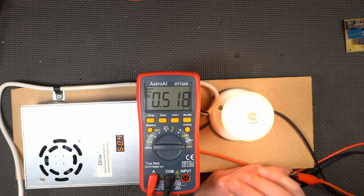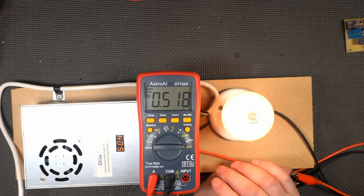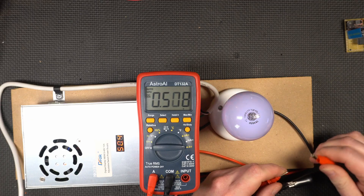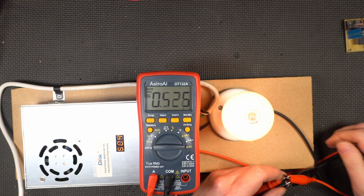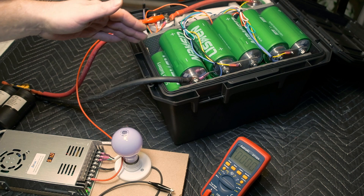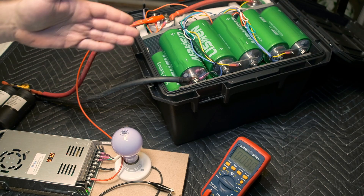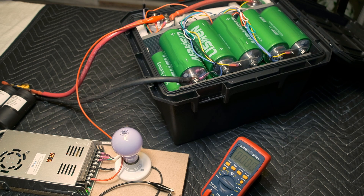Just make sure if your battery pack doesn't have cell balancing, you manually check it while you're charging. You don't want to overcharge one cell at the expense of the others. So here's my oddball battery — it's a 50-volt, 20-cell LTO battery. It's going to be used for the electric turbo test. It's only 18 amp-hours capacity, but it can output well over 1,000 amps without breaking too much of a sweat.